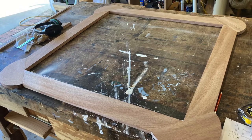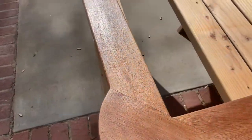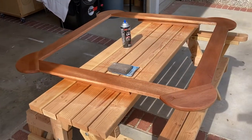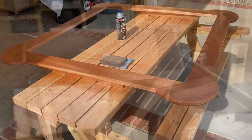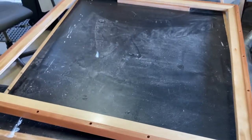It's worked out really well, and of course we need an apron to go around the bottom side of this. So we did some sanding on our top first, rounded over the edges, and took it outside to our big paint booth. A couple of spray cans — and did that. And then our apron — you can see the underside of the apron here. We used our pocket hole drill to make these lines, because that makes a flat top on the inside of the screw, so you're not putting in a wedge shape to help split everything apart. And when you put it together, it winds up looking like that.